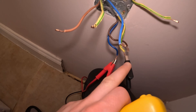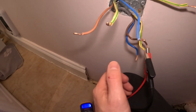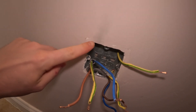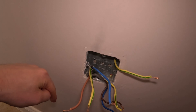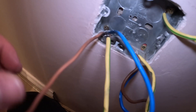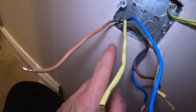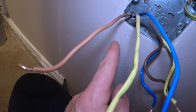While I've got the multimeter out, I thought I might as well test the other cables as well. Nothing between neutral and earth, nothing between live and earth, nothing between live and neutral either — so the cable onwards on the rest of the circuit is fine. It's this one that is the problem. I just noticed — not sure you can see it on camera that well — but there's a little smoke mark here. I think when I flicked it on it blew, leaving a slight bit of burning. I've stripped away some more of the grey insulation, but unfortunately I can't actually see where the damage is. I think we've got an earth-live short with damage somewhere just underneath here. The damage must be down here because it's burnt and smoked up here, so it must be close — somewhere around here.